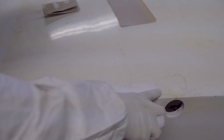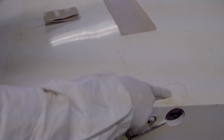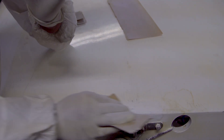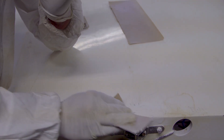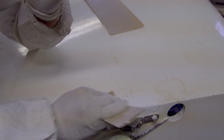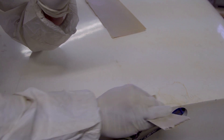The other big thing — especially with gel coat where you're not going to apply another coat — is that you're not sanding in one direction the whole time. Even at 220 grit, when you rub and buff a boat all the way down to a gloss, if you've rubbed in one direction the scratch marks still shine through, because the 1000 to 2000 grit rubbing compound is very fine compared to 220. Instead of sanding in just one direction, small circles prevent those scratches from building up. A little variation in how you're sanding prevents a lot of work on the back end when you're using rubbing compound to get the 220 scratches out of the gel coat.